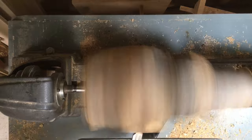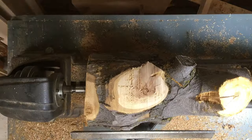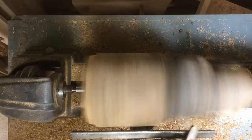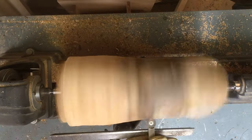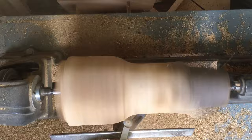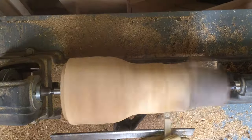This thing was definitely gnarly. You can see my lathe is bouncing around — it was quite a bit out of balance. It took me a while with the roughing gouge to just get it somewhat stable. I went between the roughing gouge and one of my carbide tools in order to just take the big chunks out of it, get it as round as I could, and smooth it out to make it a little easier on my lathe and easier to figure out what kind of final shape I was going to end up with.